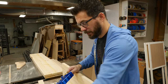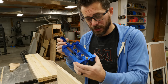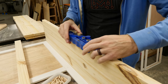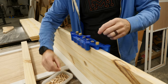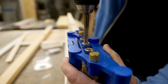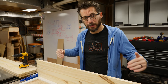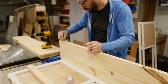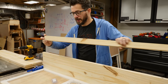My edge banding worked out pretty well. I've got to sand it down a little bit, but next we need to attach the front lip to this whole thing. I'm going to use a center-finding jig — this looks fancy but it was really cheap on Amazon. I'll put a link to it with all the other tools we use for this. Basically you just lay it on top of the piece and this part flexes and makes it so that these holes are centered within your piece of wood, so you can just drill down and get a center hole. That hole is going to let me put in a dowel to connect the front lip and glue it all together — it'll be nice and strong. Now that we've got those holes drilled, we need to make matching holes on the other piece of wood using these doweling centers. It's just a little point that you drop into the drilled hole, then you set your piece of wood on top, line it up, push it down, and that little point leaves a recess on the back side for you to drill the matching hole.